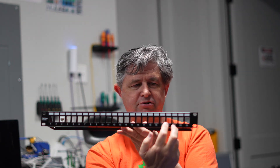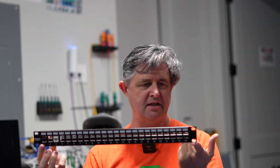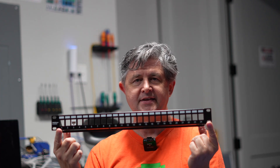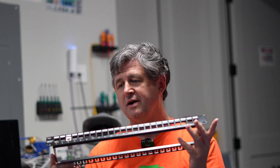They also make LC fiber and all the different fiber connector types in keystone versions, so you could have one patch panel with all RJ45 plus a couple of fiber connections. It's a really neat way to do it. All the patch panels in this house — I think maybe 35 or 40 of them including AV — use these keystones. It's a little more expensive, but not much difference. You can also buy keystones in different colors, which allows color coding for different networks or different types.